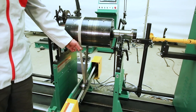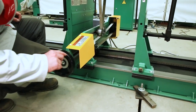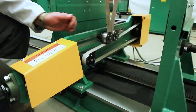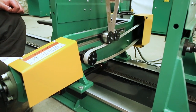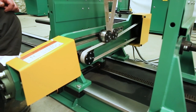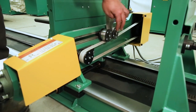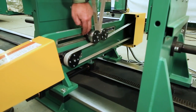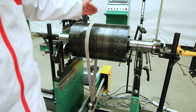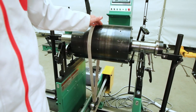The next step is to put on the belt and stretch it with the help of the steering wheel. When stretched, the roller moves. There is a fairly large range here in order to accommodate the rotor from a small diameter to a large one. These two rollers also move along the grooves for a larger girth of rotor diameters. The minimum sufficient girth angle of the rotor belt is at least 120 degrees; the optimal angle is 180 degrees.